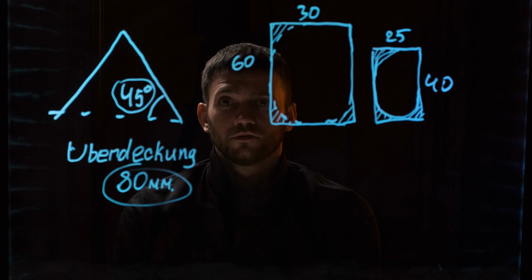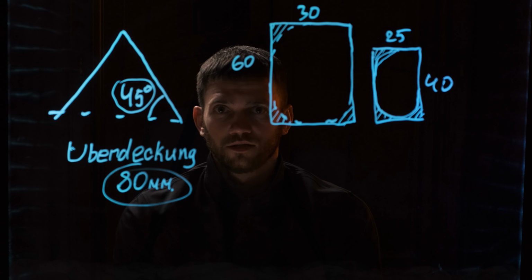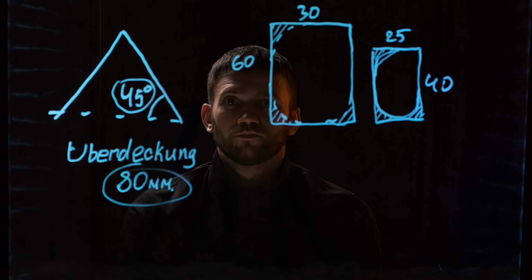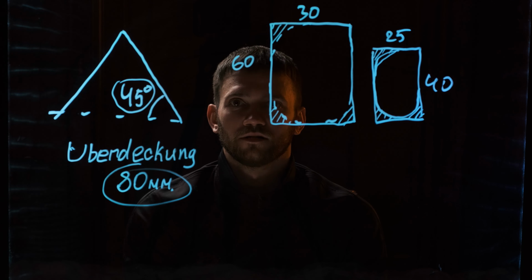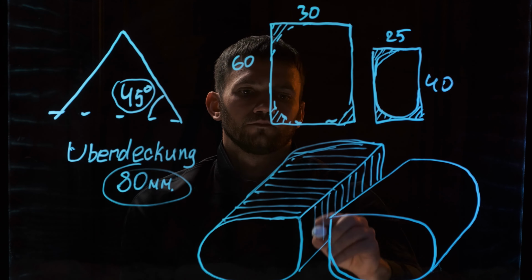You should not be lazy and tap around the entire edge so that there is no machine cut. Create a manual chip on the stone. You can experiment with the shape, the angular one also looks good. Almost each of these stones will be further developed on the roof. When you have a solid supply of such stones, you can go to the roof.